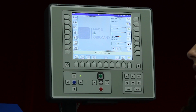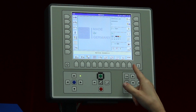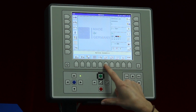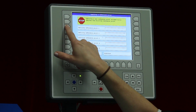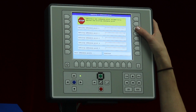I'm now right at that center point and I want to save it as a reference point. I'll exit the menu using the yellow arrow button and click Set — that would be U6. I press that and now I can define the reference point. On the left-hand side you have the ability to set the reference point, and on the right-hand side you have the ability to name the reference point.